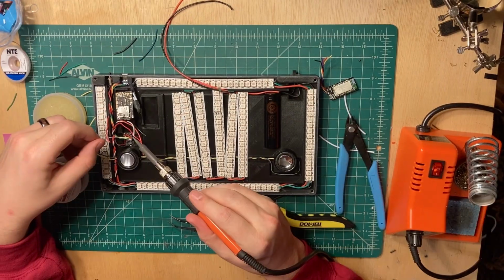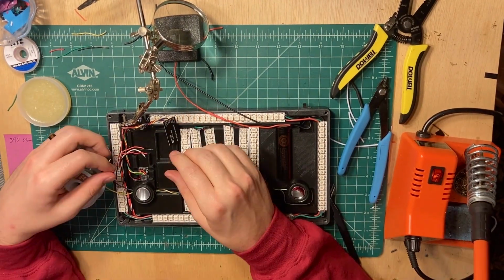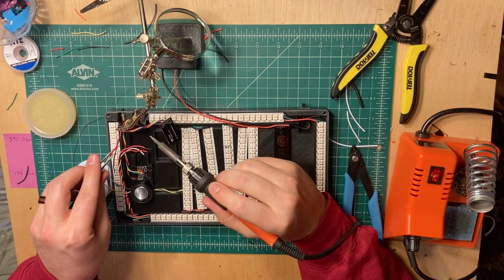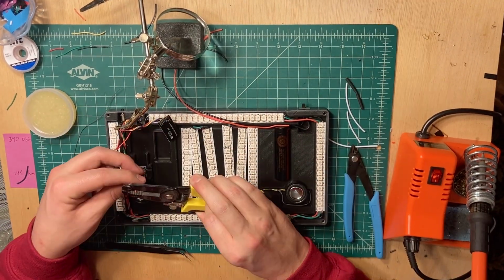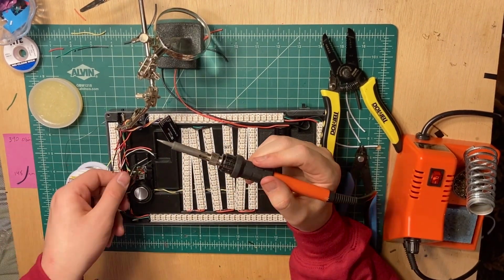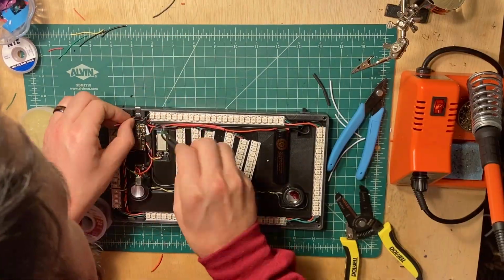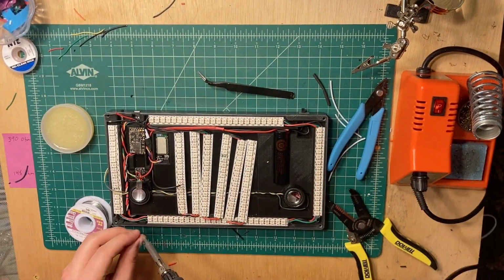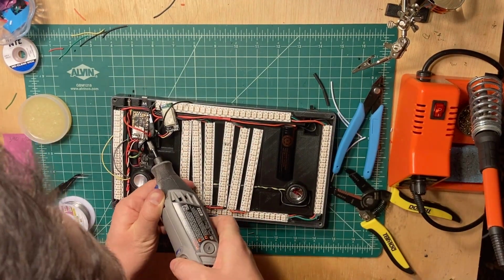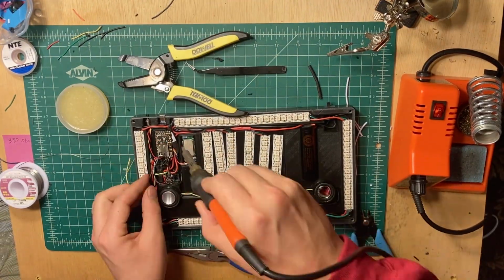Additionally, I underestimated the amount of wiring around the soundboard, especially since I added 2 chips to allow for the USB-C charging and data connection. So I ended up having to take my Dremel and make a little extra space. Also, the LEDs would have benefited from being a little bit lower down inside the base. This would have helped with diffusion later on. So I made the adjustments to the design in Fusion 360, but didn't feel like reprinting the whole base at this stage and just proceeded with the project anyway.